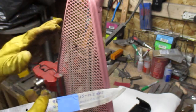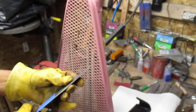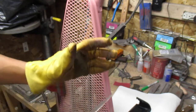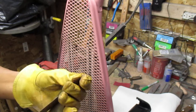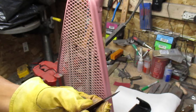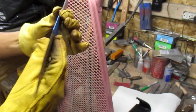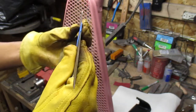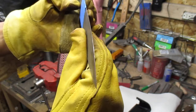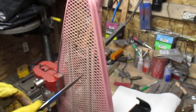It's much higher than the manufacturer's max Rockwell, which is 62. If it was any softer steel, I would have massive roll — it would roll with this edge this thin, causing a massive roll instead. There's not much sunlight, but you can see there's no big major reflection. It's hard enough and strong enough to resist this.